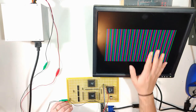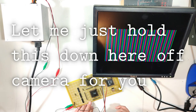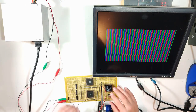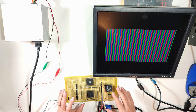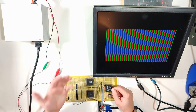But at the moment, what you're seeing is the direct output of those signals on the screen going through this very simple digital to analog converter. The signal's pretty wobbly, probably mostly due to the fact that I have no decoupling capacitors on here or anything. It's very noisy. But basically, for today's video, what we're going to try and address is the fact that there is nothing coming out of RAM yet. As it turns out, we're actually pretty close.